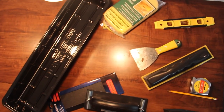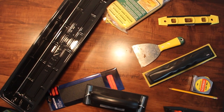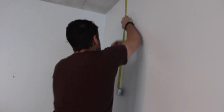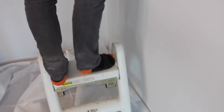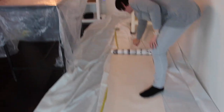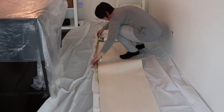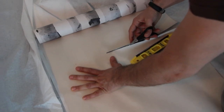Here's a look at everything you'll need for this project — I'll list it in detail in the comments and description below. First, you start off by measuring the length of the wall. Once you get it fully measured to the ground, lock the measuring tape in place and lay it on the ground. Then roll out your wallpaper to the length of the measuring tape, giving a little extra — maybe 5 to 10 centimeters on each side — and then cut. Make sure you give that extra slack on each side so you can line up properly.